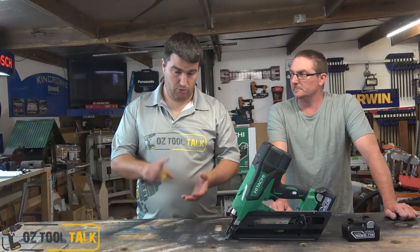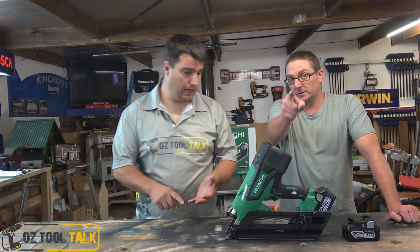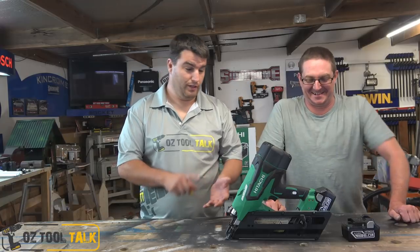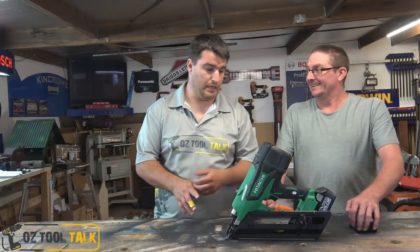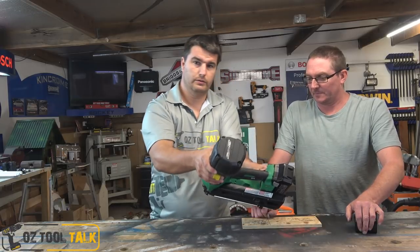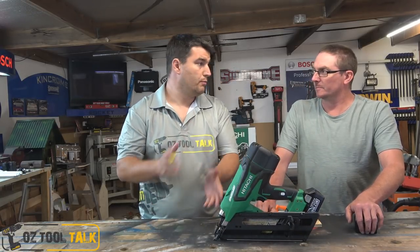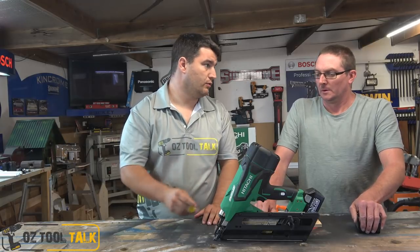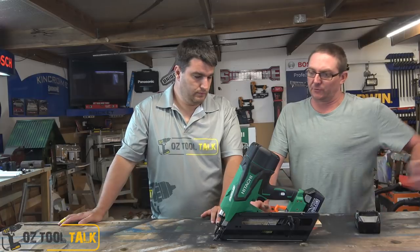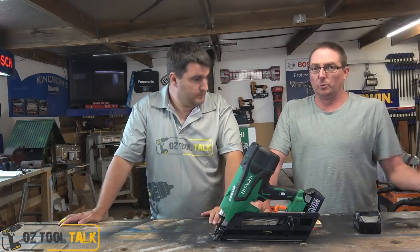Same as the other... You've probably seen my 15 and 16 gauge review. Hopefully. If you're worth your salt, you would have watched those already. So it works basically the same in that you've got an on-off button down here under the handle. And then you've also got your switch between bump fire and single fire modes. The bump fire's important because some guys, if you're running along doing a top plate with your stud wall down, you'll want to just bump along.